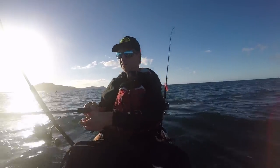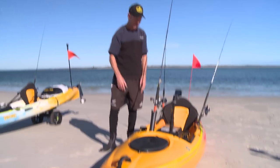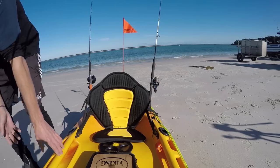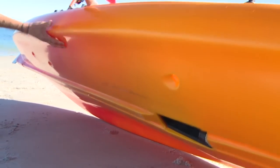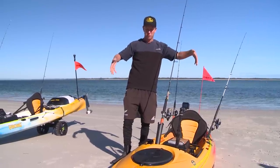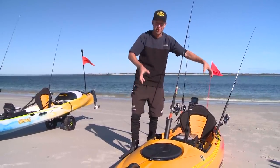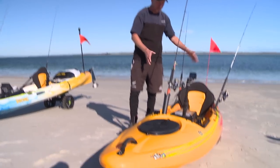Now one of the secrets to that is the stability. It's relatively wide, it's quite short so nice and compact, easy to cart around, and the stability is because of these reverse chines. It turns back down which gives a good suction onto the water and that acts almost like an outrigger canoe. So it's almost like you've got these extra two hulls out to the sides giving you plenty of stability — nice and stable.